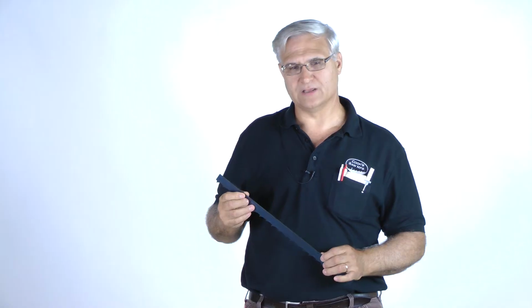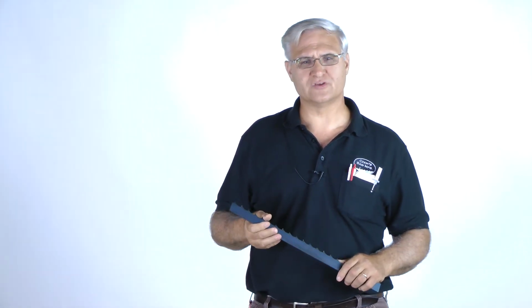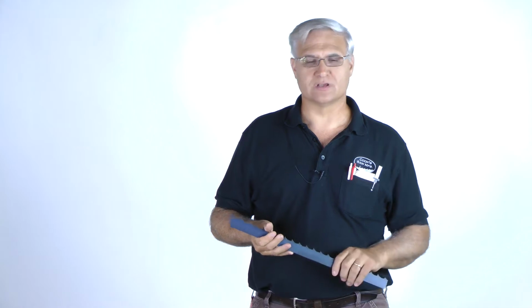Wanted to bring you a video this morning and talk a little bit about the thickness of thin kerf bandsaw blades. Thickness is very important according to what situation you're in, but the whole idea of the thin kerf industry was about saving sawdust, or saving wood, leave it in the board and not make sawdust out of it.